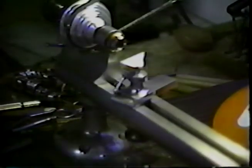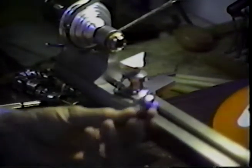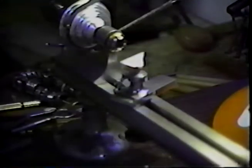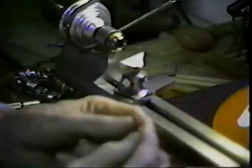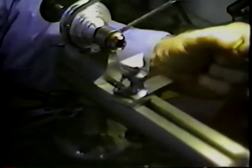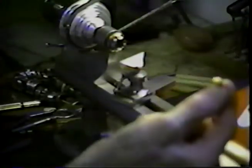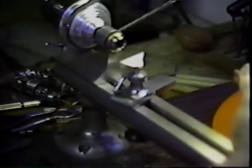We've turned the camera back on. In the period since the last shot, I've selected collet number 65, and I have a piece of stock from a hard bronze rod — a quarter inch in diameter and approximately 418 thousandths of an inch long. I picked it out of the scrap box. It's a completely adequate piece of raw material to mount in this collet and make the knurled nut.